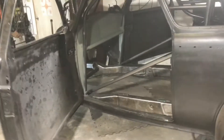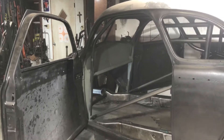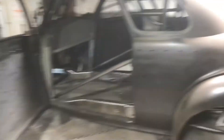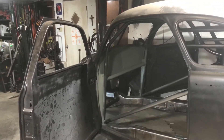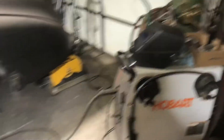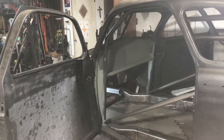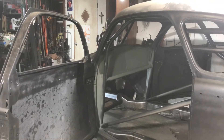I probably spent five or six days working on just these four pieces to fit in there. It's a lot of trimming and trying to mock it up, get it in place, and get it to fit. Climbing in and out of this car — I've probably been in and out of this center section about 70 times just to fit these four pieces and get a good fit. On the mild steel I'm running my MIG welder, and the 1/16-inch isn't bad to weld — it's plenty thick.